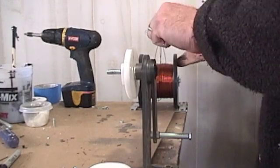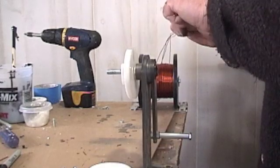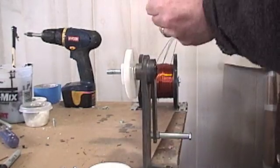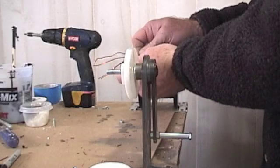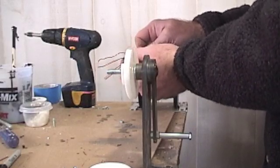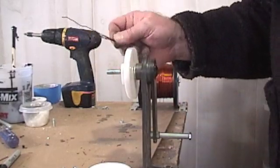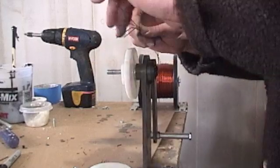To wind the coils, take a spool of 18 gauge wire and you need four strands. You're going to take that one roll and empty it into equal divisions on other spools, then rewind it on your big spool so you have four strands. Kind of a pain, but it sure makes this easier.